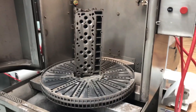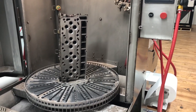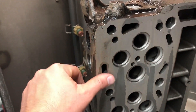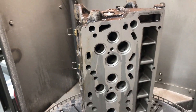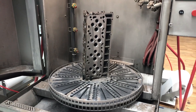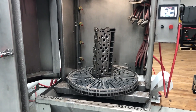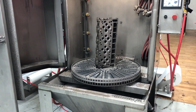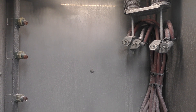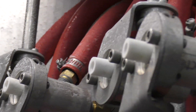This is an automated, hands-free blasting and parts washing process, with the benefit of abrasive liquid scrubbing and cleaning those surfaces much better than your traditional parts washing process. Oftentimes with parts washing you have gunk, gasket material, and all kinds of unwanted things left on parts even after the process has been done — and that's where this machine steps in and takes it to the next level.